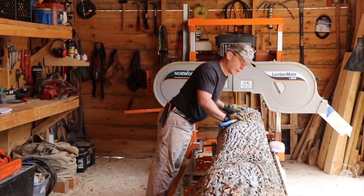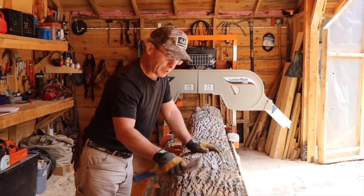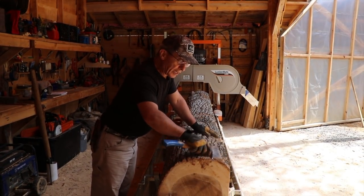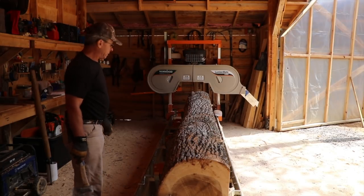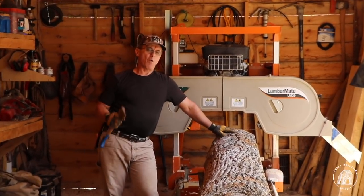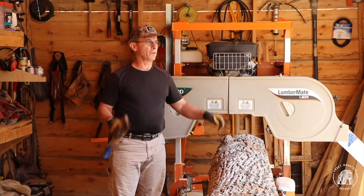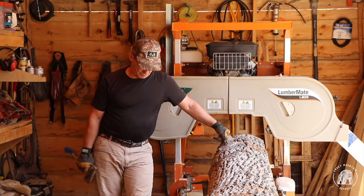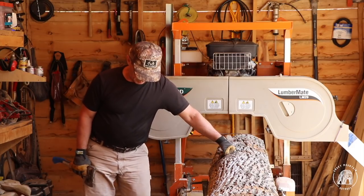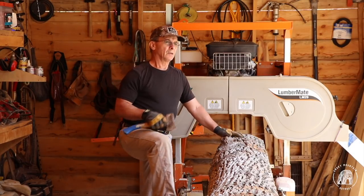Another idea I had mentioned was the rain catchment system, and I had a lot of people write to me about different people on YouTube that I could go check out who have put in some water catchment systems that did a really good job. One guy was in Arizona, another couple was in Texas. But I still have the idea that I want mine underground — I don't want them above ground. There are some suggestions about building a wall around them, but I wouldn't have to if I put it underground, and I wouldn't have to insulate it either because underground it would be ground temperature pretty much all the time, which doesn't freeze if you go deep enough.